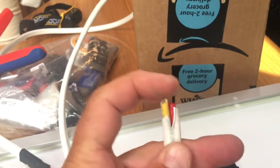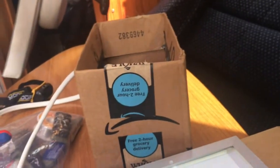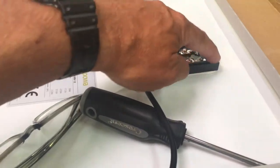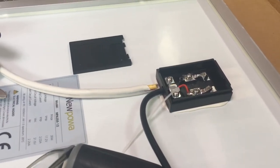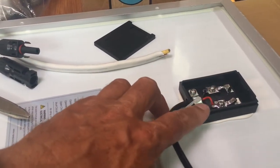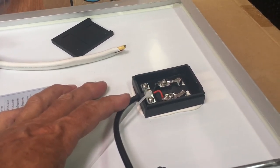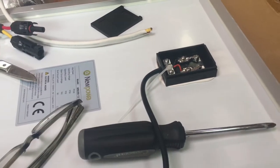I'm going to strip these wires back and put on the connectors, then find a way to strain-relief this wire. I'll use marine silicone around the box to seal it and make it watertight. Some people complain about the missing diode, but this is a $40, 35-watt solar panel with tax delivered — it's good value and seems well built.